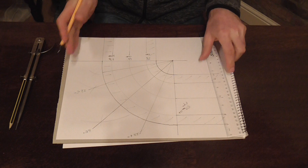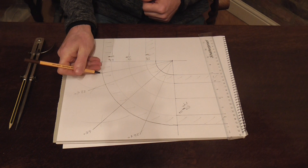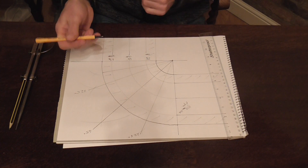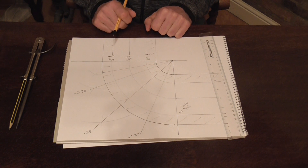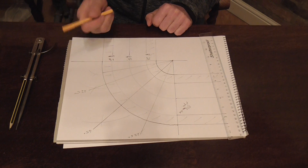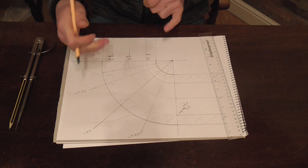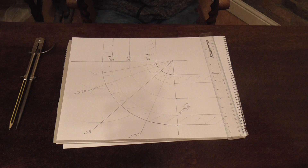So that's our plan view developed. If you take measure from the bottom to this point here, that will give you the outside of your starter. If you take it from the bottom and measure up to this point here, that will give you the inside of your starter. Draw in the two lines, cut across them and that will give you the starter — if you cut it and place it on there it will fit perfectly. For your segments, you measure from this point to this point to give you the outside of your cut, and from this point to this point for your inside cut. You'll see that it fits perfectly between these lines. You want three segments, a starter and a finisher, and that will construct your bend.